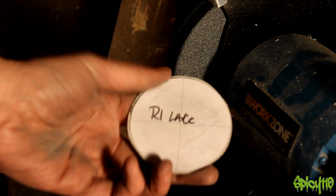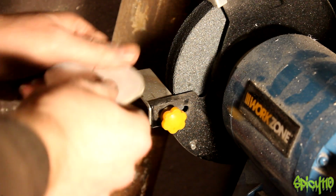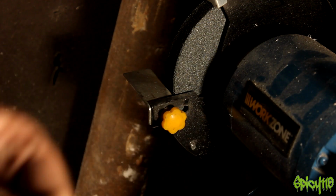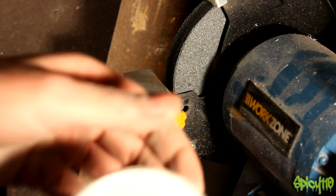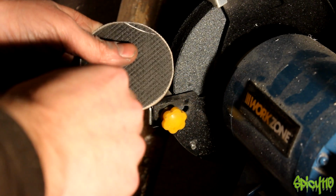Right, I'm getting there, but man, this 1mm is so much harder to get through than the half mil. The half mil is up, and it's kind of done. I'm really grinding through this. It's good because it means you get more control over the edge, but I'm getting a little bit of delamination on the bottom edge where it's getting a bit fluffy, but I'm running that round on the belt sander on the other side just to clean it up.